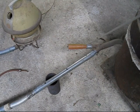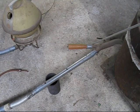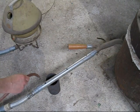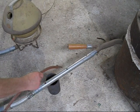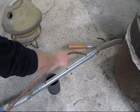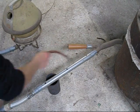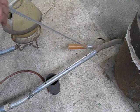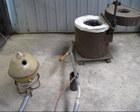Also, someone's going to ask why there are two inlets in my propane burner. Well, I built this about 27, 28 years ago, roughly, and I thought two vacuum cleaners were always better. They're not. It does not need two vacuum cleaners. So this is what I'm going to do. This is one hole here, it's going to sit in like that. The same with here, there's another hole, and there's another hole just there. That's how the demonstration will show that it does not matter where the pipe from the propane bottle goes in. It's very flexible, this burner, and easy to build. In this demonstration, I'll be starting from the hole that's furthest from the furnace, and it'll show you that it's very flexible about where the propane goes into the burner.